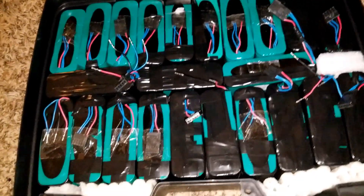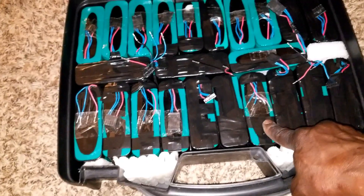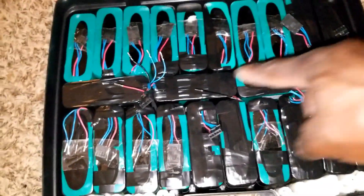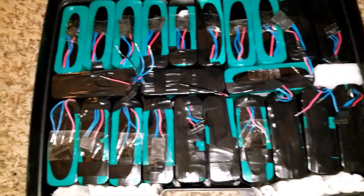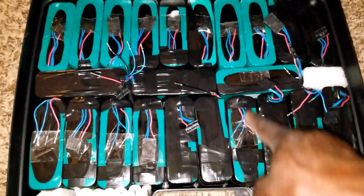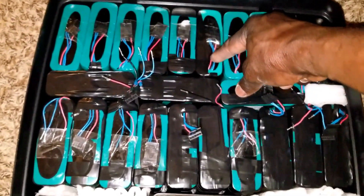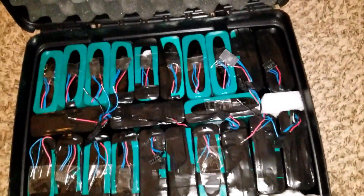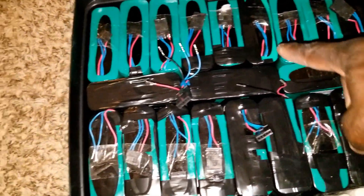I've sealed up this battery pretty well at the bottom and the side. What I'm gonna do is wire all these batteries in parallel so they can be 12 volt. Each row here is 10, so I'm going with 10 and 10. I'll use styrofoam to stabilize the batteries, get them facing this way and the other ones facing that way, so I can connect positive to positive. Then I'm gonna solder a wire going across - a heavy gauge, approximately 8 gauge or 6 gauge wire.